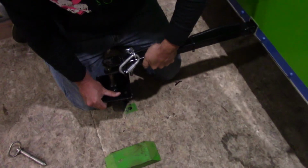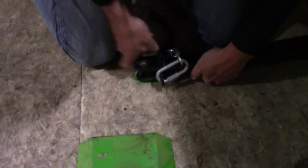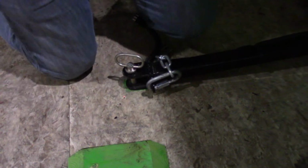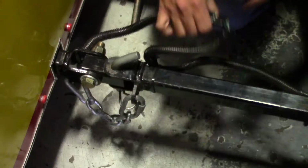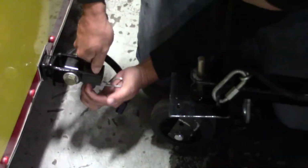Once positioned, remove the caster and set the hitch down over the hole drilled into the floor panels. Put the clevis pin through the hitch and into the floor panels. This is the extent of securing the train cars to the trailer. Repeat those steps for the remaining 2 train cars.